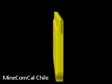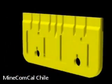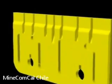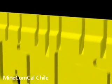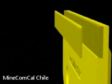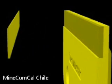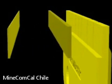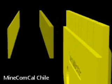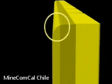The dirt whacker blade system is engineered to significantly reduce blade and conveyor belt top cover wear. The thermal grooves minimize thermal stress on the blade and hard metal insert. The soft metal insert protects the hard metal insert from mechanical and thermal shock. Dirt whacker blades provide a wear life of 15 mm hard metal. Utilizing a rounded leading edge, the dirt whacker blade system can be applied to the conveyor belt at a greater force than the conventional scraper.